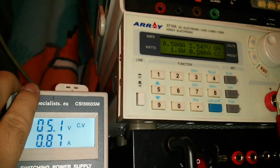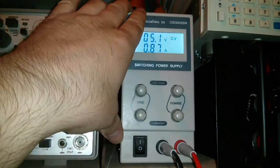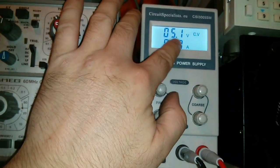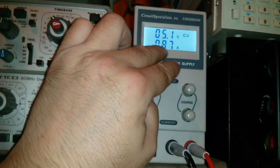I'm just going to run that for a few seconds and then switch off, and just test the case. That's nice and cool - just wanted to make sure it wasn't rapidly heating up. Let's put it back on again. The reason it's not heating up is because we're actually below the regulation voltage - it's actually barely doing any regulation at all. Now, if we whack it up to 30 volts, that thing's going to be absolutely stressed to hell - it's going to be dissipating huge amounts of heat. We're not going to do that, but we're just going to turn the voltage up a bit.